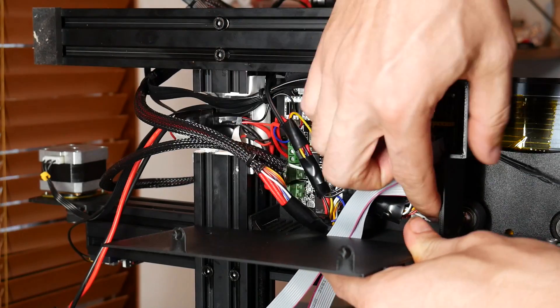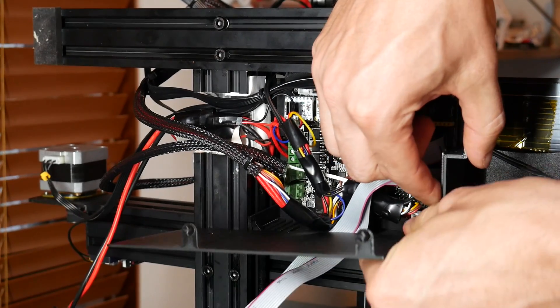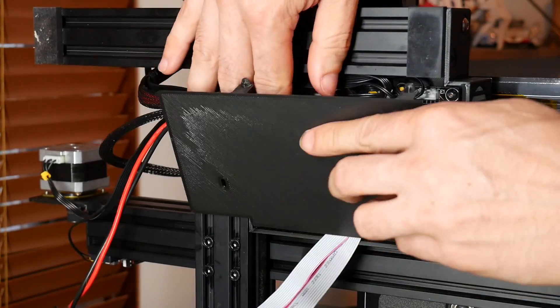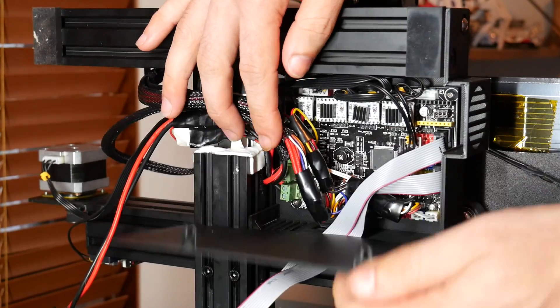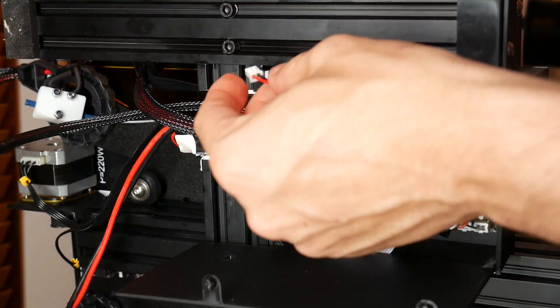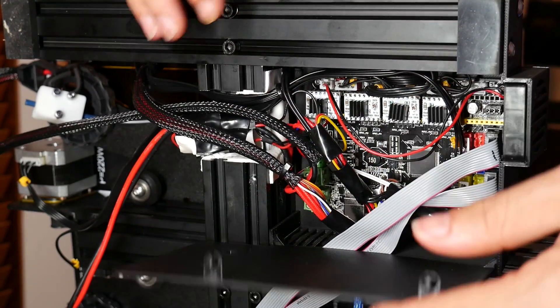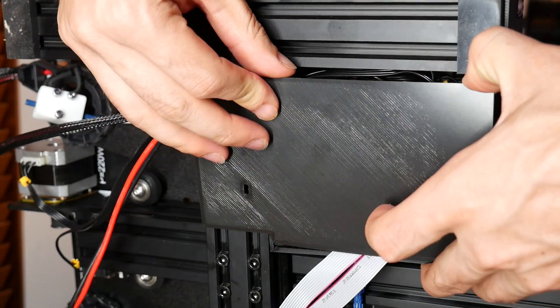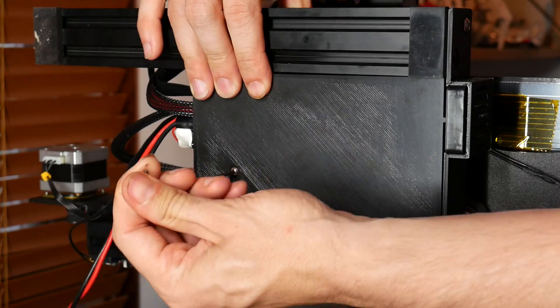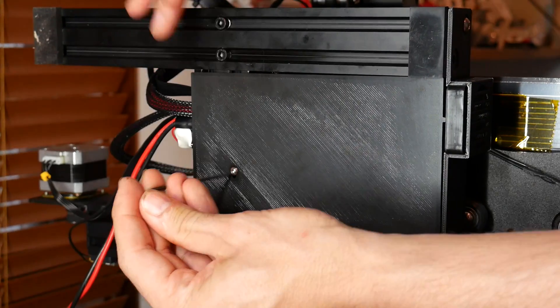At this point take the printed lower lid and squeeze it so the two hinges pop into place on the ends. Make sure to feed through the LCD ribbon cables first — they'll have a nice little slot for the exit. The final component is the mainboard cooling fan; it slots into place and then plugs in in the very upper left hand corner. The lid is designed to stay closed without the screw, but optionally you can add the screw and it goes in exactly like the factory one. Go to the description, print out the checklist, and take your time plugging everything back in.